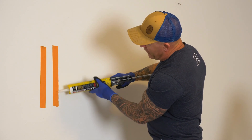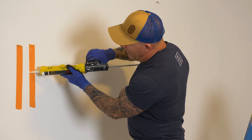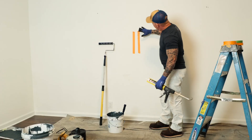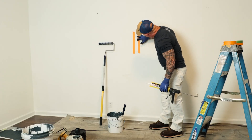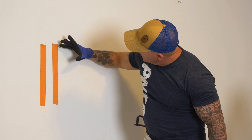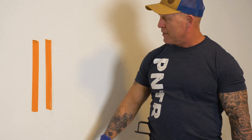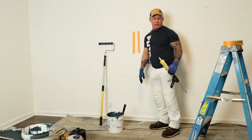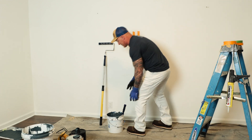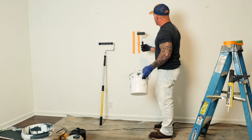I'm going to take and wipe this off — I'm actually trying to wipe all the caulking off and not leave any behind. This is actually sealing the edge of that tape. That one's sealed on both sides; the other one's not sealed. Now I'm going to show you what happens when I paint that surface, pull the tape off, and see what it looks like — caulked and uncaulked.